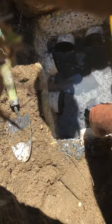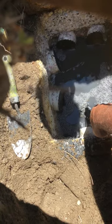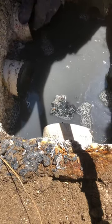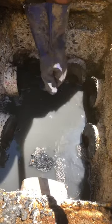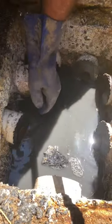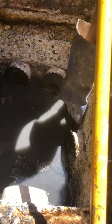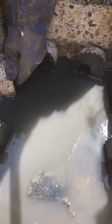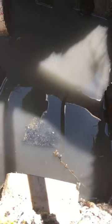What we're going to do now is test the water flow and adjust the speed levelers to see which sections are taking in the most. We need to adjust that far end a little higher. Now we're correcting the problem and it looks as though we've got it pretty even — all sections are accepting about the same amount of effluent. This one here seems to be taking quite a bit too.